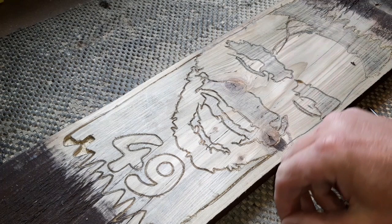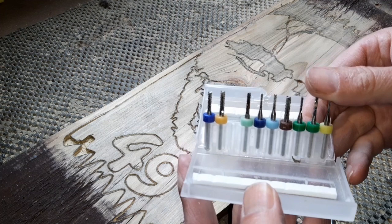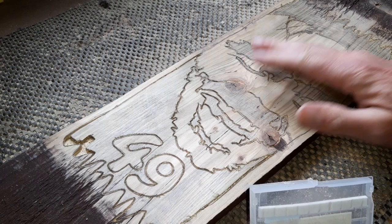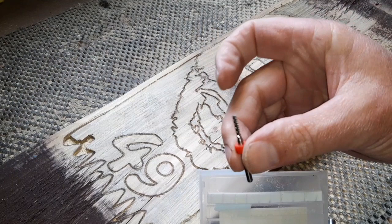That's come out no problem whatsoever so far, we say. Now we're just going to pop on one of these end milling bits. They're eBay or Amazon again, and they're ideal because they route out the side walls as well as the bottom section. So you'll have a fairly smooth surface, depending on the quality of your wood and stuff. We've picked out a nice small one.